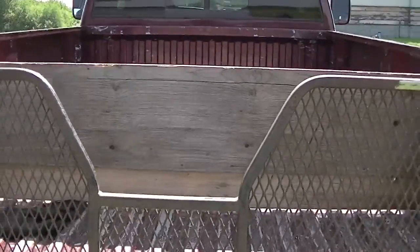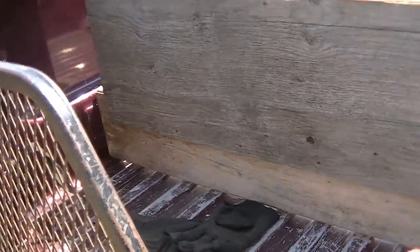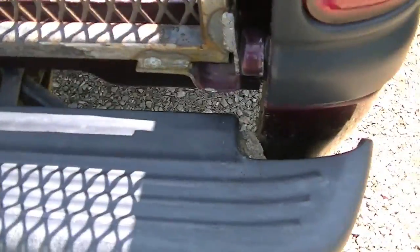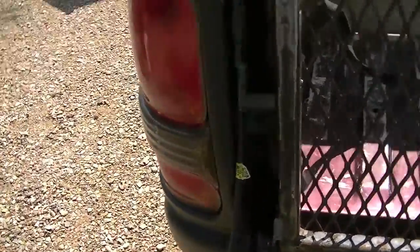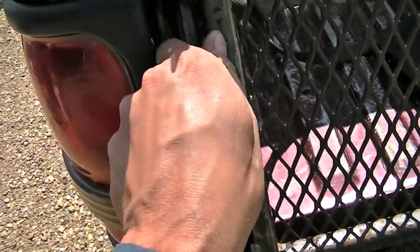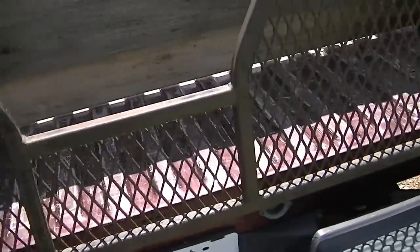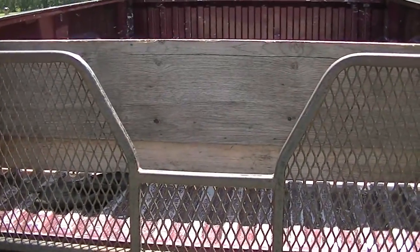Now what I need to do is fill this in — see if I have any square tubing — and then clean all this up, plate this off, and clean up all those welds. I've also got to rig up these straps because they're held right here. I need to take this bolt out, make a spacer, make a shoulder bolt, because the bolts that were in there aren't long enough and the threads are shot anyway. So I'll make a new one, get those wrapped up, and figure out what I'm going to do for a latch. The next video of this project will be the latch mechanism. Take care and talk to you later.